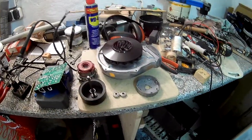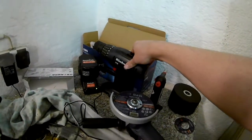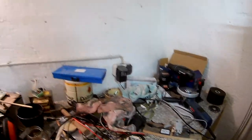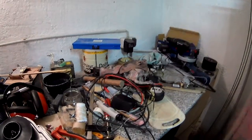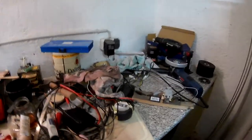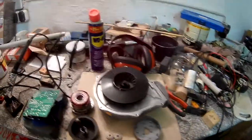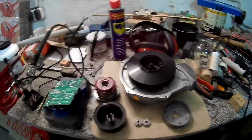I've also got a new old battery drill — it's 18 volts. When I wiggle it the LED changes brightness, so it's NiCd or similar, and I was told the battery is a bit weak. What I might do is replace it with a lithium cell, just like I did with another drill. I'll still try to repair the original drill, but for now I can at least use this one. That's it — see you in the next video.